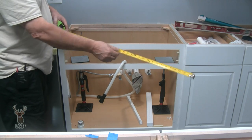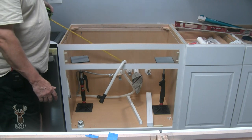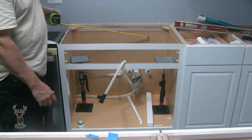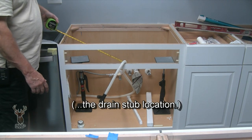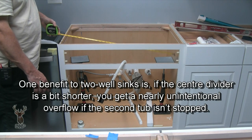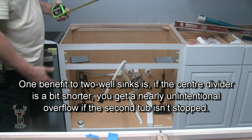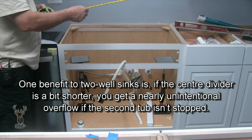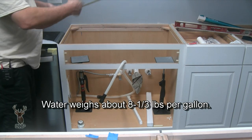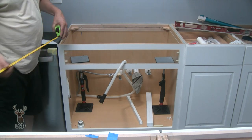One of the things they all have to have is water valves — these are your potable water supply. I have an extra one because I have a whole house reverse osmosis system. Here's your issue: where is this located in your house? Because if you want to do a shallow sink, the depth isn't a big deal. But if you want a deep well, you have to know where that stub-out is — that's where we go next.